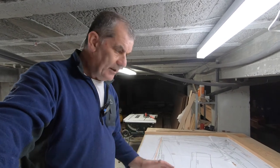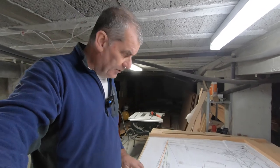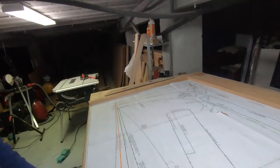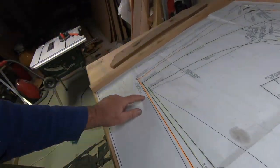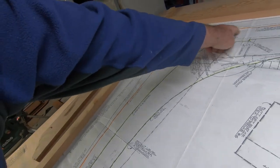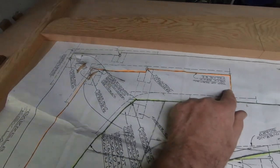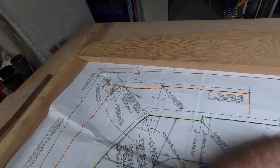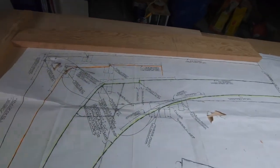I've done the transom now on the first frame. There's a total of seven frames apart from the transom and I am now on frame number two, which I've got on the plan here. This is highlighted in orange and the deck inlay goes in there. This frame cuts short because this is the engine bay — there's a big gap with double doors that will give us access to the engine, whatever that may be.